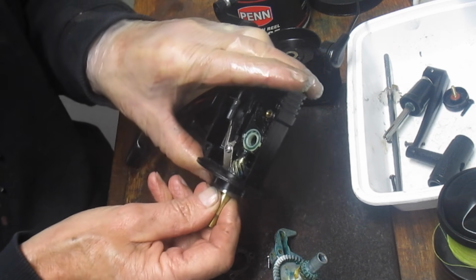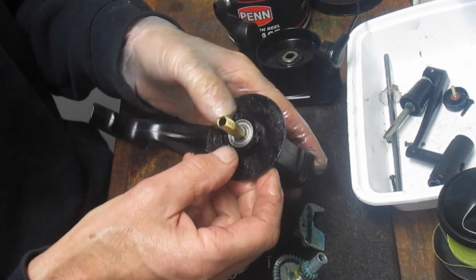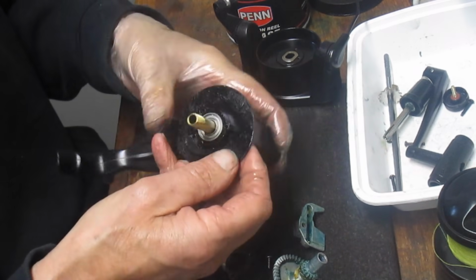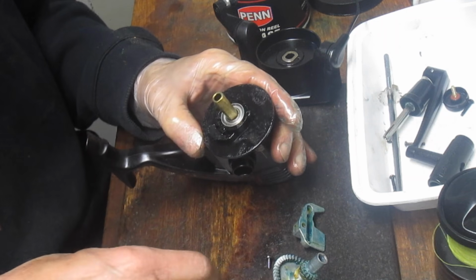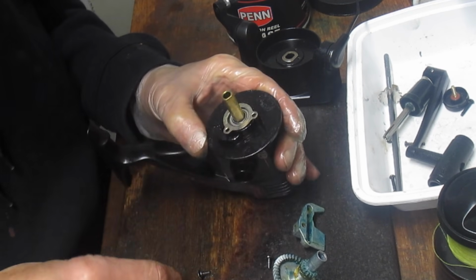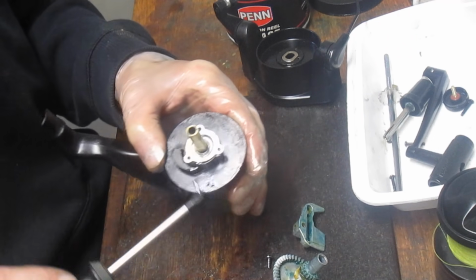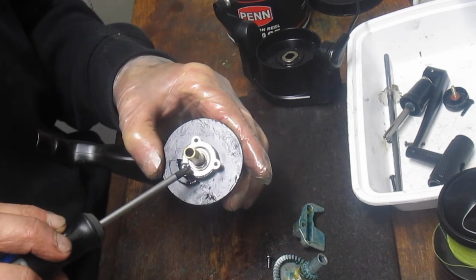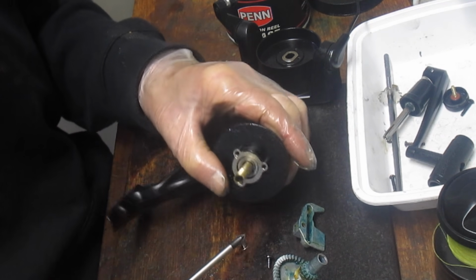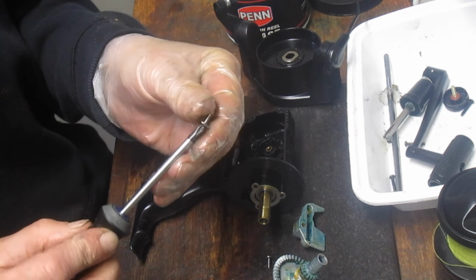And then what we're going to do is we're going to mount that into the holder. Press down on the bearing to make sure it's in the case completely. Grab that collar and line that up with the sides. Grab those screws. Now that is one advantage to steel screws. You don't drop them as much. The disadvantage is they will rust.